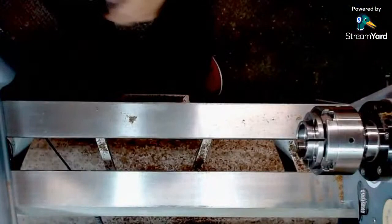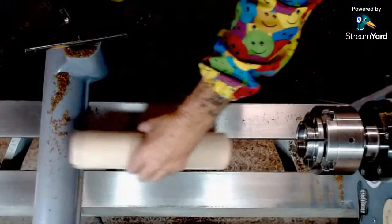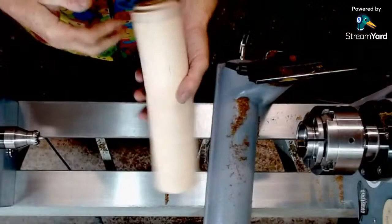Now, next piece of wood. This piece. I always do it different to that. Do you? I always lock my chuck in place, and then it can't tighten anymore when I turn the lathe on. Yeah, exactly. Always tighten it up with a good knock. A loose chuck will tighten when you start turning, and stretch the threads as well.